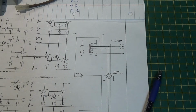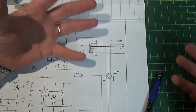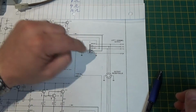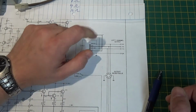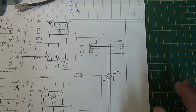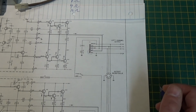They talk about the McIntosh sound, and that their old solid state amps have a very warm sound like a tube. Well, that's why. Tube amps, by their nature, have a matching transformer and output taps, and you can match them. And you also realize very quickly that if you hook an 8 ohm speaker to the 4 ohm tap, bad things happen. Especially in the amps that aren't as well designed, really bad things can happen. You could damage the tubes and all kinds of things.